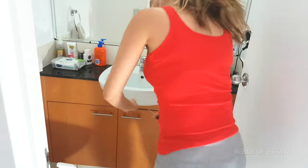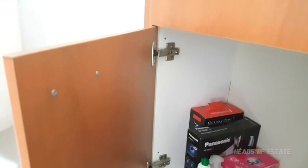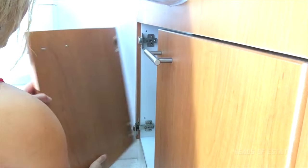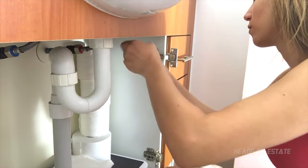For your first step you will need a screwdriver and some cleaning solution. I've chosen sugar soap, which is good for cleaning those dusty, greasy, dirty surfaces. First, take apart your doors and drawers and give them a good clean with sugar soap. Take off the hinges and unscrew them to release the door so you can take them apart and wash them.